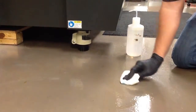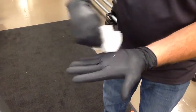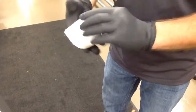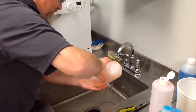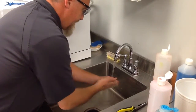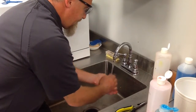Spills on surfaces and impervious clothing can be wiped clean with small amounts of alcohol. Make sure the area is well ventilated and away from sources of combustion or ignition. Mild skin contact with UV inks can be cleaned easily using copious amounts of soap and cool water. Do not attempt to remove UV ink from skin using solvent or thinner.